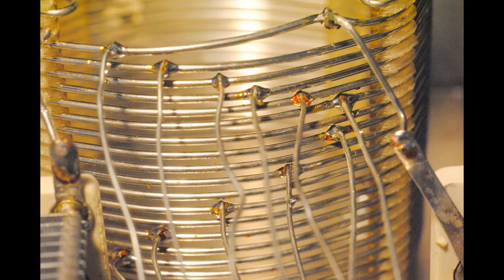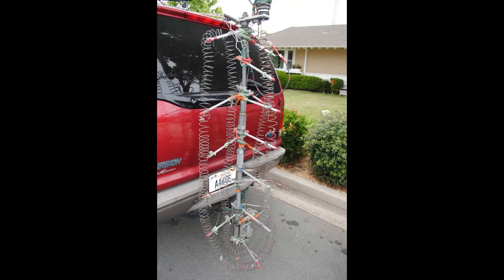A lot of folks have experimented with some of the older ones. Gosh, remember the Swan antennas, and remember the Webster Band Spanners? They had all sorts of coil arrangements down there at the base. Some hams have gone very exotic and actually have pre-wired all of the antennas on a coil right down there at the base. Well, this one, you almost have to shake your head going, holy smoly, all this coil matching down at the base to bring it up to 50 ohms.